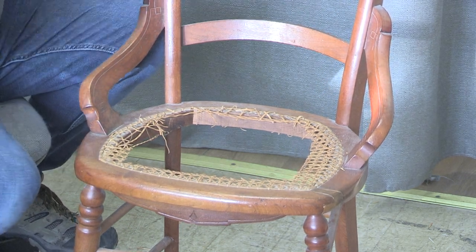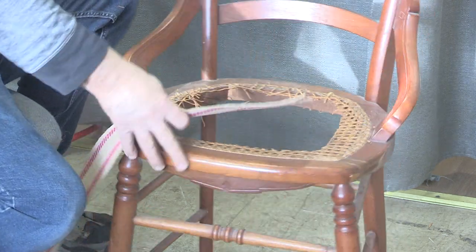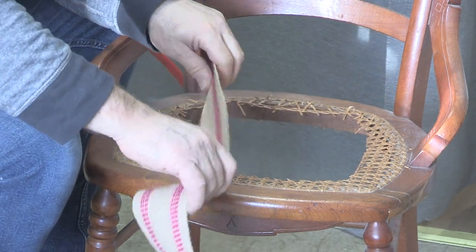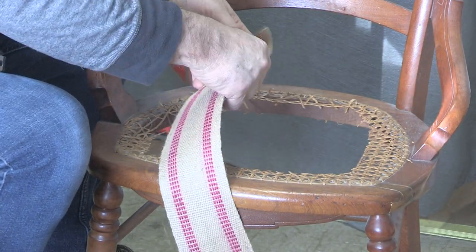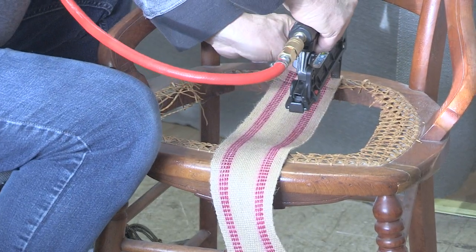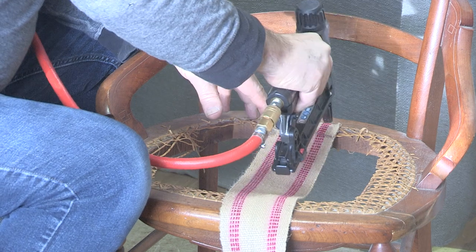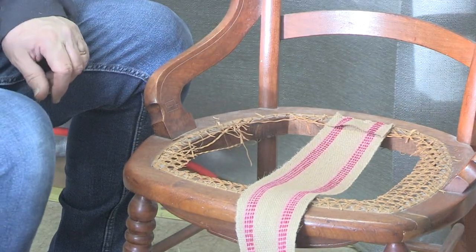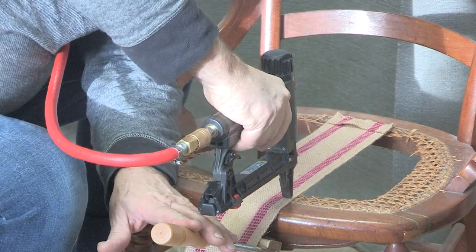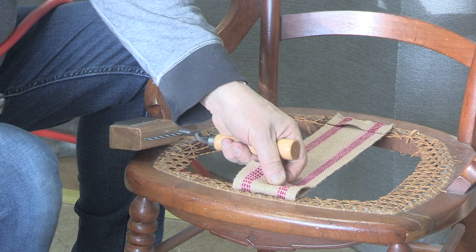Let's get a little webbing on this to see what's going to happen. You need to be really careful with these frames — they're not like real upholstery frames. I think I want to put three pieces of webbing on here. I'm doing this on the floor for the benefit of you guys. I'm going to try to stay inside the caning, towards the interior of the chair. I'm folding it over and stapling — you want 3/8 inch staples. Get your five in, then take your webbing stretcher and stretch it, staying inside the caning. Cut that off and staple it down.